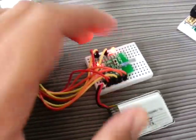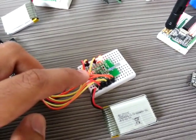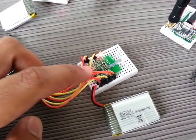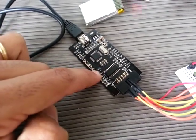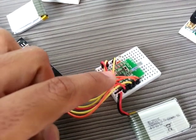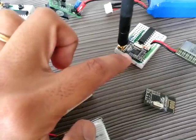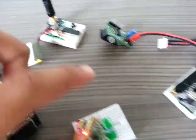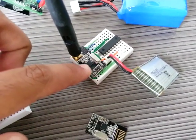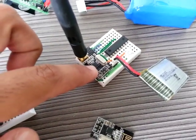This is a board I bought from the do-it-yourself embedded website, which has an NRF24LE1 programmed using a flash programmer I bought on eBay. For this board I'm using the SDCC compiler. This other board is the same as the transmitter but works in receiver mode, also using the Microchip PIC16F628A with an NRF24L01.